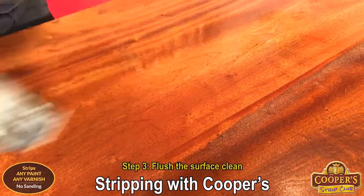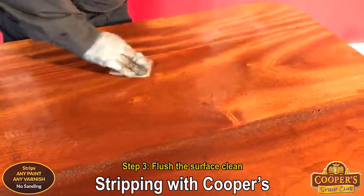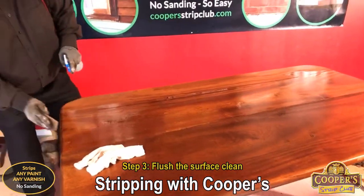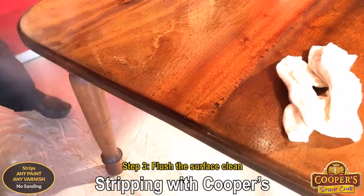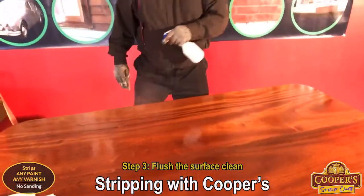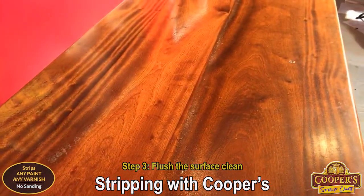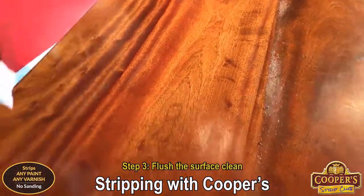Any sanding leaves little scratches — they're supposed to be there. So with the flusher you're spraying and you're scrubbing at the same time. You're not putting it on like the stripper and leaving it. If you use meths or thinners they dry way too fast, and in the case of thinners it just stinks. There's virtually no odour. As we said before on the leg, the wet look is the finished look. So while you do this, you're watching all the time for any blemishes that you might discover and dealing with them accordingly.